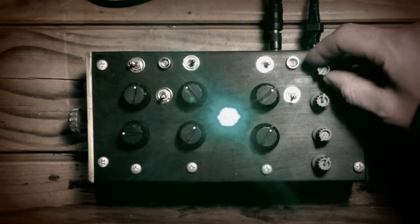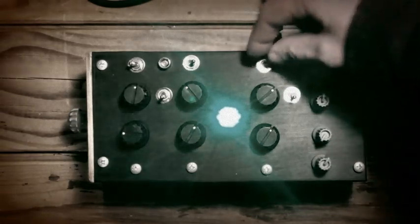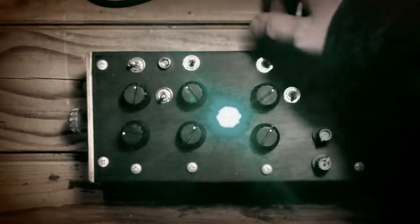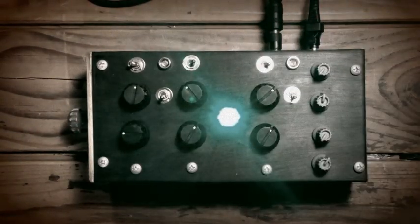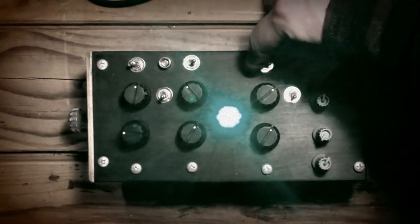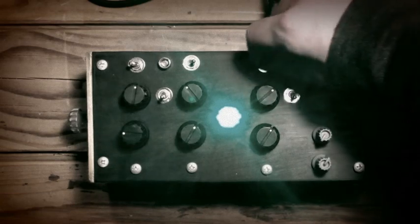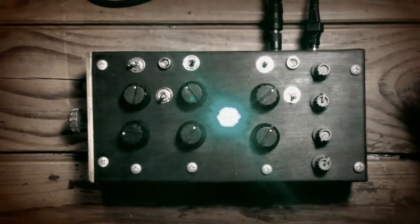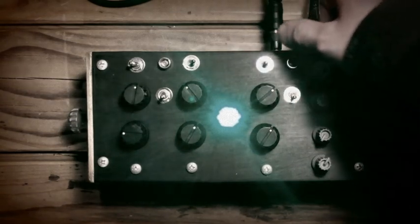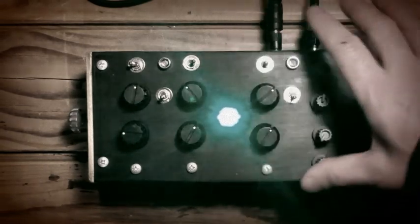Here we have the global volume, and the uppermost selector knob in the drone section here is the frequency range, which is, let me see, the lowest to the left. In the middle, it's basically no capacitor selected, so you will get some super high frequency fragments, which I really liked for the diversity.